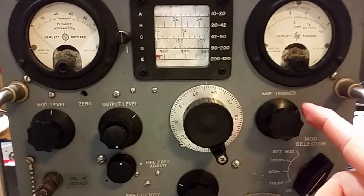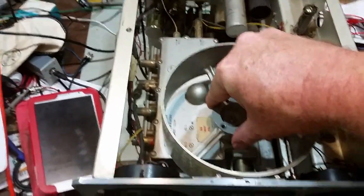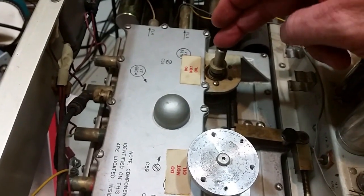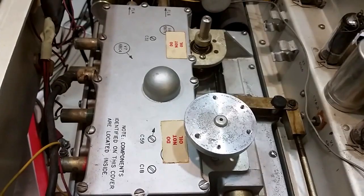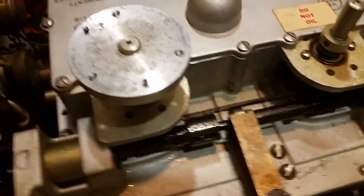This one is handled mechanically and is pretty interesting. If you look in the top, this is the frequency dial here. There are three screws that normally hold it and two pins that make it so it can only be positioned where you want it. In here there are two — this front one is the oscillator, and this back one is basically the amplifier — and these are the two stages you want to have track if possible. When I tune the frequency, you can't really tell the back one is turning, but they basically turn in sync. There's a pair of worm gears in here — a worm gear there and a worm gear there — so they turn in sync with each other, driven by that worm gear.